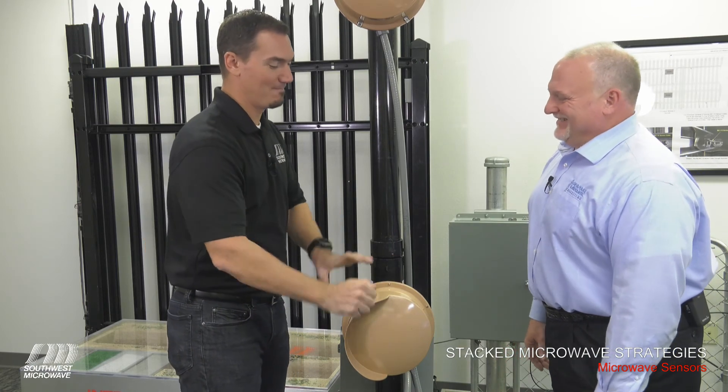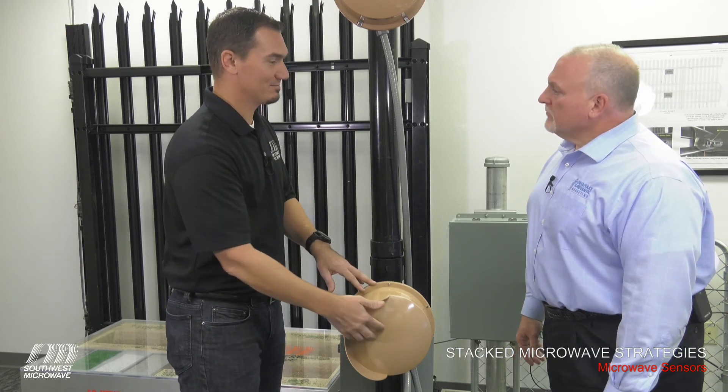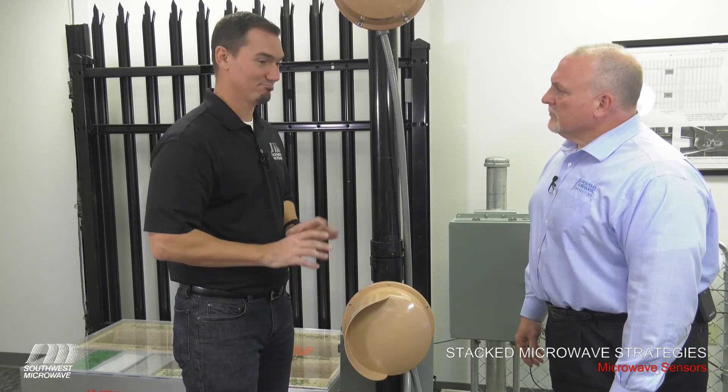When you rotate the head, take the radome off, rotate it back and reinstall it, wax the face of the radomes, do a visual inspection, and that's about it.